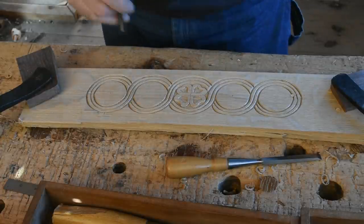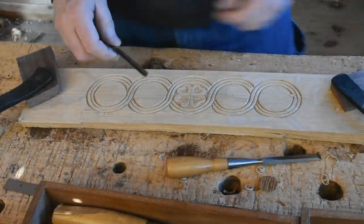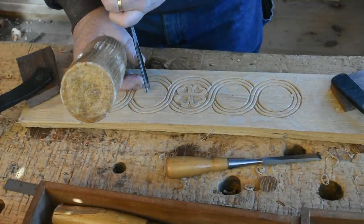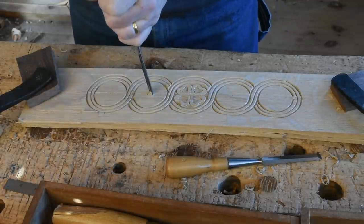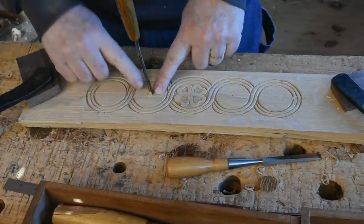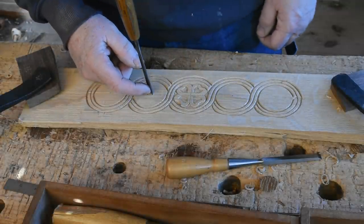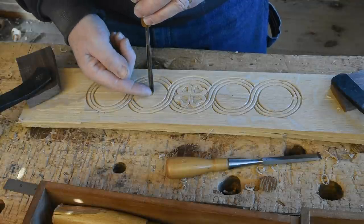One of the flower shapes that goes in here, I'll start with this tool, which is a 1/2, 1/2. The circle is 1/2 inch and the width of it is 1/2 inch. And right around my center point, I sort of strike this to outline a circle. When I'm doing this kind of thing, particularly with something so narrow, I tilt the tool towards those flutes there. And that lessens the chance of this lifting up.